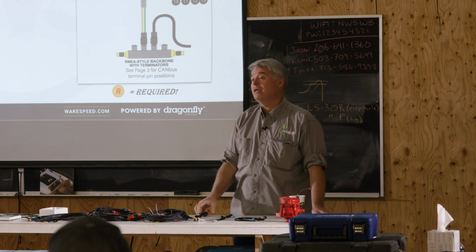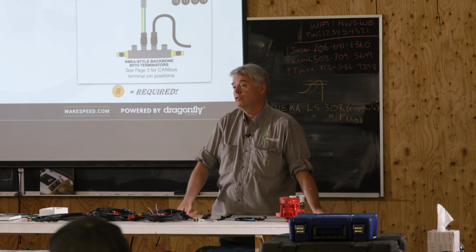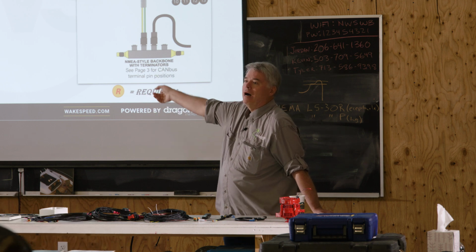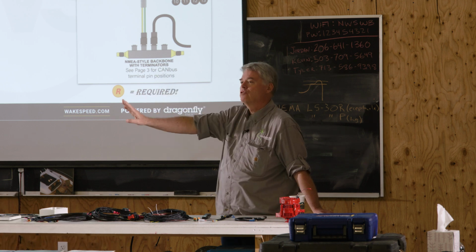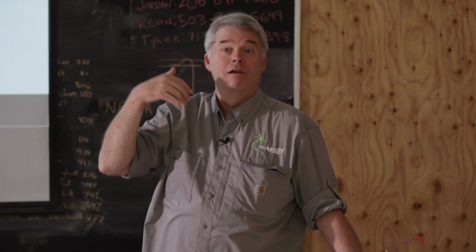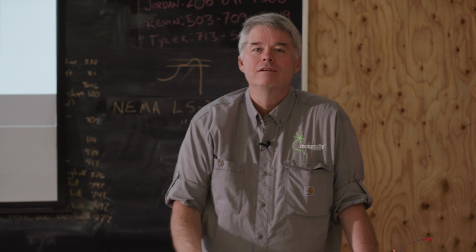Probably the number one complaint or service call we get around the Lynx BMS is they've not done the white wire correctly. And unless a positive voltage is applied to that wire, the regulator stays in standby mode. So you get the call, why is this thing not charging my battery? Well, there's why.